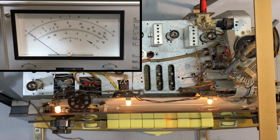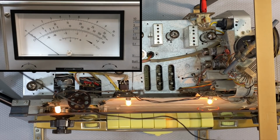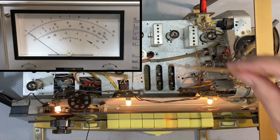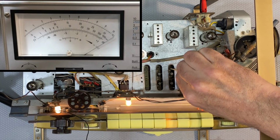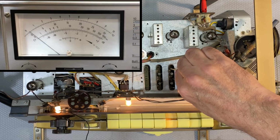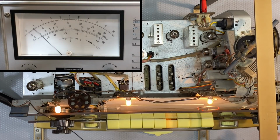And I'm going to adjust, what do they tell us to adjust first? First the oscillator and then the antenna coil. Just check which one is the oscillator. L8, okay. So it is that guy over there. Okay, I need a different stick. This should do it. That one there. There we go. Whoops, that's a bit loud. That is near as damn it.